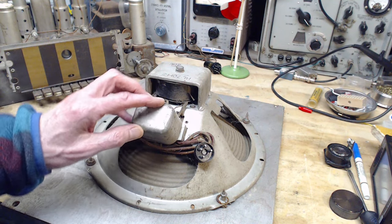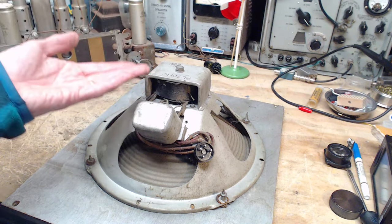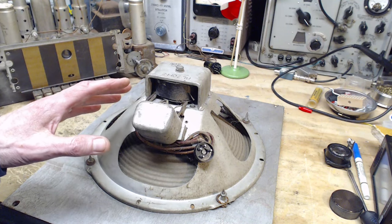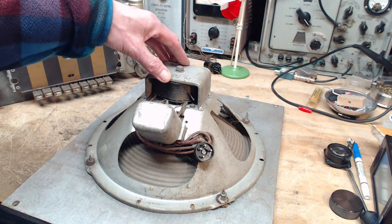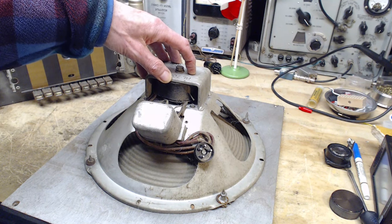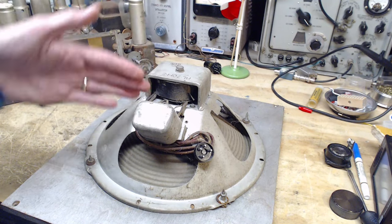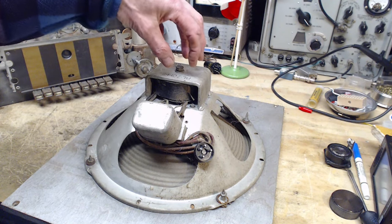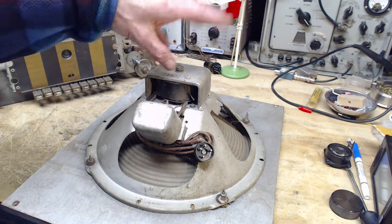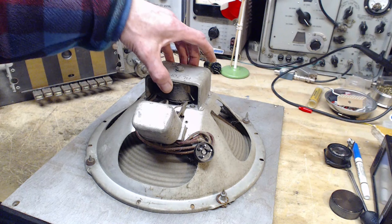And the way these things are looked at, at least in the power industry that I'm familiar with, there's probably something similar done here. The assumption was there's a high temperature you don't want to cross. Let's say it's 90 degrees C. Then thinking further, well, if this whole thing were 90 degrees C, there's probably some spot inside that for some reason is extra hot. If the average is 90, there's some hot spot that's going to be above 90. How do you get to an average anyway? So that thinking, and giving consideration to the idea that there could be a hot spot in the way this was wound, or who knows, there's an allowance made for that, and that's how they rate these things.